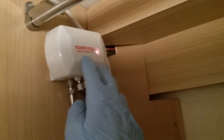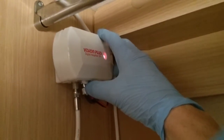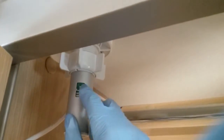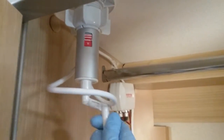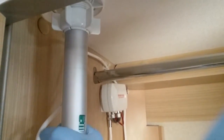In the wardrobe we have the television aerial. The digital amplifier for it is just here, on and off just underneath here, and then we can control the boost just here — just make sure it's on a normal boost, not on a low boost, otherwise you will not be able to tune a television in. To pop the aerial up, just undo the collar just here and then just push up and get it into the position that you require. This green window here represents the back of the aerial. Once in the position that you need, lock it into place. At the moment the aerial is sitting in the horizontal position — it can be twisted into the vertical just by turning the tail just here. Do make sure that the aerial is down for travel.